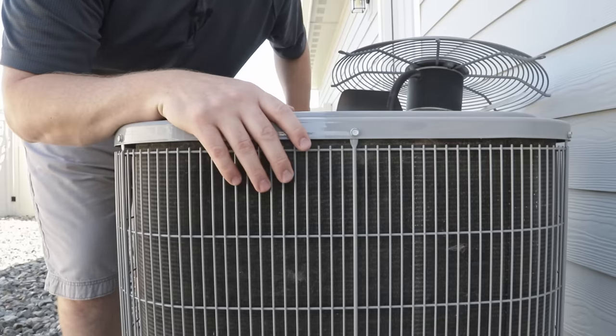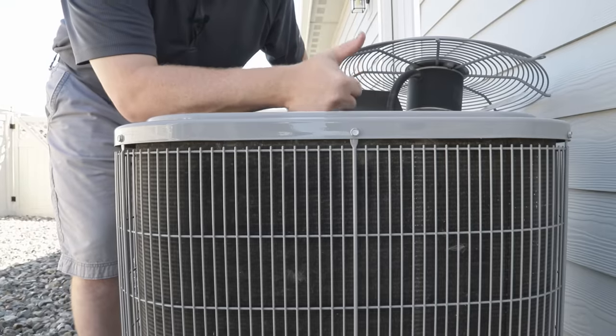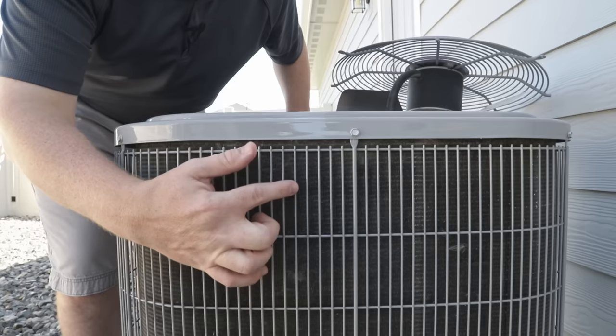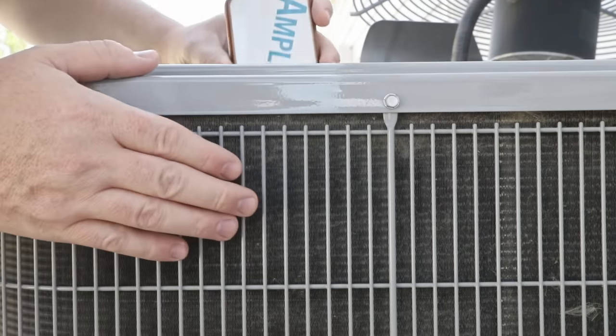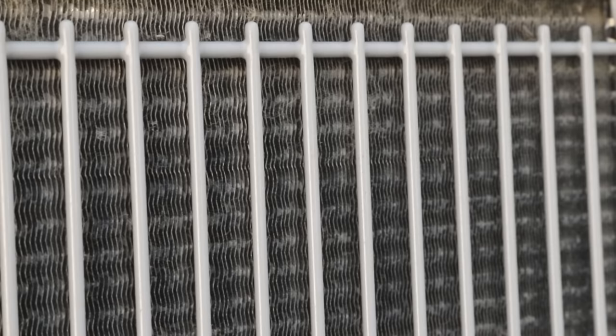When your air conditioner is running normally, the condenser unit sucks air in through the outside of the fins and blows it out the top through the fan. As a result, a lot of dust and debris collects on the outside of the fins, which slows down airflow and makes the system less efficient. One way to check how dirty they are is to shine a flashlight from the back side through the fins — you can barely see the light. Here's another shot showing fins that are really caked with dust and dirt, and my buddy's were really, really gross.